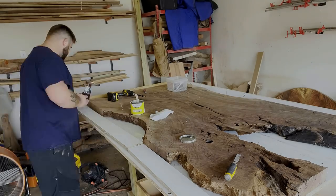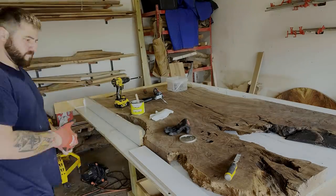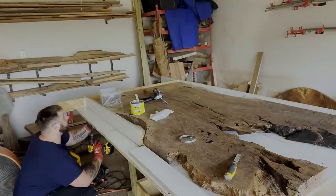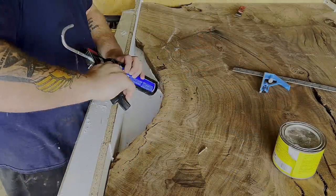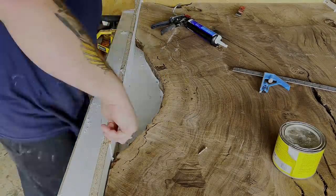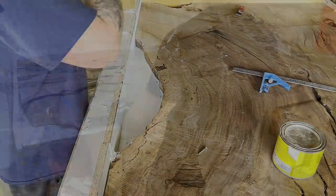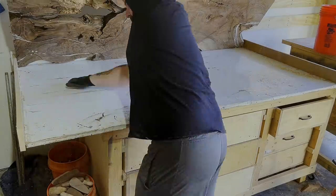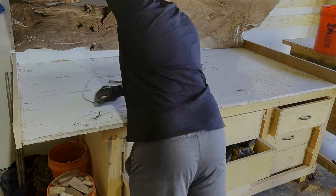This isn't the big screw up I'm talking about - I'll go ahead and spoil this one: it worked out remarkably well. The last time I tried paste wax was on my little Texas ebony side table, and I don't think I used enough. That's what led to the semi-failure - some pieces of the form stuck to the epoxy and kind of tore it up. This time I was just going to use an excess of it, really coat everything, and make sure it wasn't going to stick.